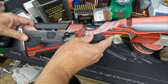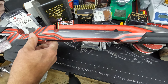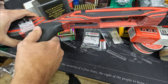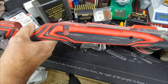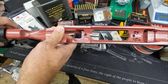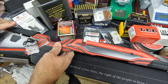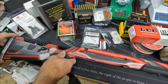In the middle here, this is a Boyd's AT-One stock for our Savage 110. We're going to see a major change in the gun — it's just a beautiful piece. I've added textured target grips and a textured fore-stock grip, but it doesn't come pillar bedded. So we'll shoot it before pillar bedding and after, and we'll bed the action at the same time. That'll be a lot of fun — beautiful work by Boyd's.